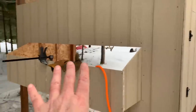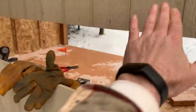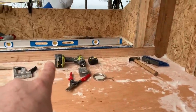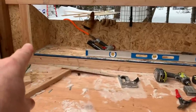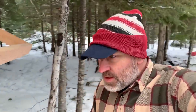Got it. Let me show you where we're at so far. Nesting boxes are coming along pretty good, right? So the lid is gonna go on like this, and it'll be like a roof for them right here. Okay, and then we'll have six nesting boxes in here. Let me show you from the other side over here. All right, so it looks like that. So the chickens have about a 4-inch step up into the nesting box right there. There'll be a 2x4 that runs along right here, kind of where that level is. That way the chickens can't just kick out all the bedding material in there.